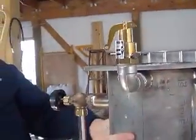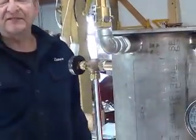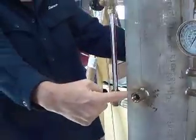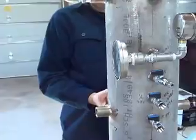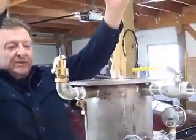I've got it set. This is going to be a 100 PSI boiler, so if I go over 100 pounds, this is going to let me know so I don't kill myself and others. Now the feed water for the boiler enters the boiler through a double-sided feed. So this is going to come around — I'll have the feed pump down here. The exhaust at the boiler comes here.